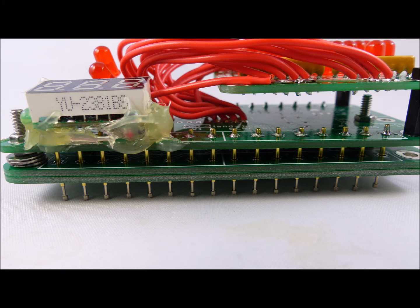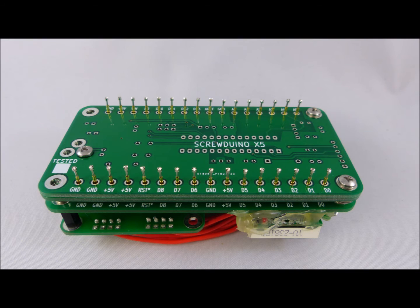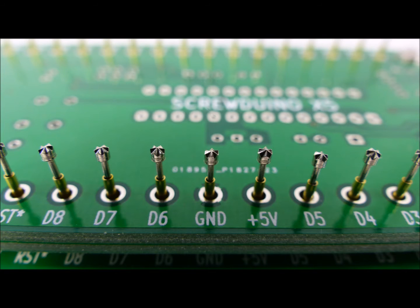For the tester, we sandwiched together several old revision cards. The lower two cards keep pins straight, and the upper card is where pins solder into. Here's the bottom view of the same card — you can see the pins sticking out from the bottom, and here's a zoomed-in picture.